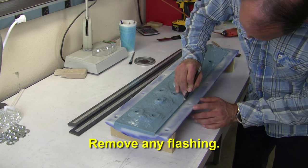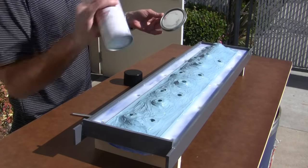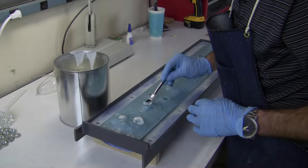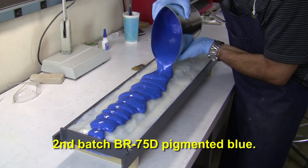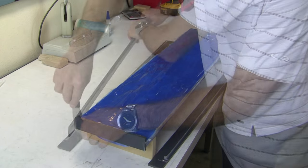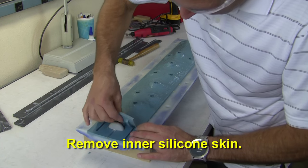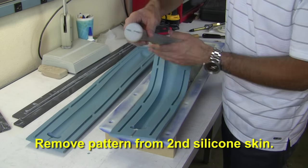Clean off any flashing with a sharp razor. Using the PVC dams, we hot glue them along the mold perimeter to prepare for the next step. Apply zip mold release to the silicone registration keys and spray the entire surface — additional coats of release should be applied on the exposed rigid mold flange to prevent sticking. BR75D is mixed and applied to the second mold half. The second layer of BR75D is pigmented blue and applied over the surface. Once the BR75D cures, remove the PVC dams, remove sharp edges with the rotary tool, and begin to carefully pry the two mold halves apart. The silicone jacket is carefully peeled off the pattern to reveal half of our mold surface. The pattern is then removed from the other mold half, and we have our completed mold.